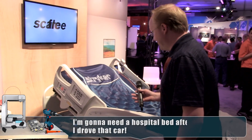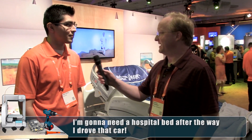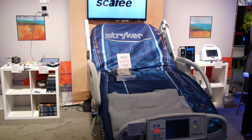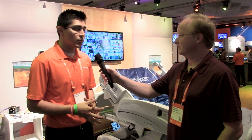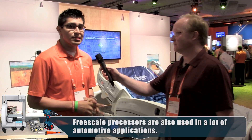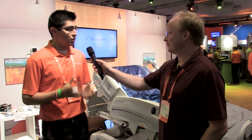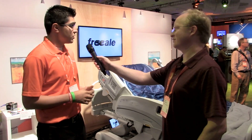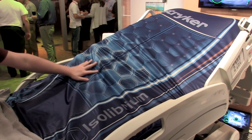What makes you the best hospital bed ever created? This Stryker bed is primarily designed for use in the intensive care unit, and it's powered by our i.MX53 microprocessor. The next generation bed from Stryker will have three new i.MX6 processors, six Kinetis microcontrollers, and four pressure sensors. The microcontrollers are used primarily for motor control — each individual microcontroller powers each motor to move the bed into a variety of different positions.